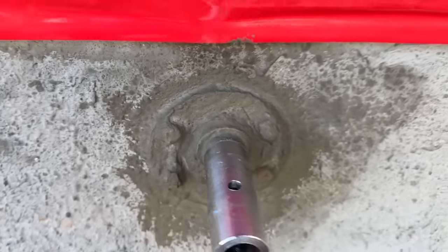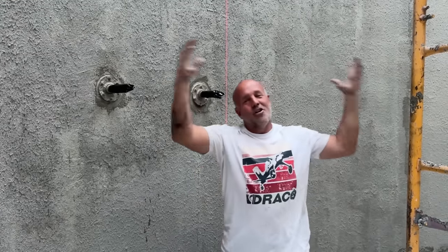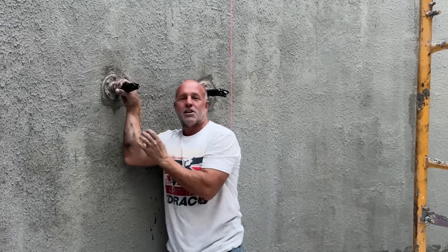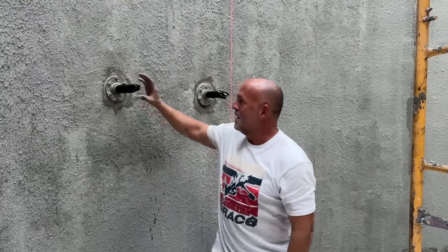Now, for the engineering side, there was a little bit of a unique challenge. I needed this ladder to be able to expand and contract if I shut this off in the winter or power outage, turned it down and the water got really cold, or if I turned it up to 104 degrees, which I will do the entire pool for a big steam winter pool party, turn the whole thing into a hot tub, this ladder will grow. So what I did is the sleeves that go over this have quite a bit of play. They have double the play that the maximum thermal expansion that this ladder will grow in height inside the tube.